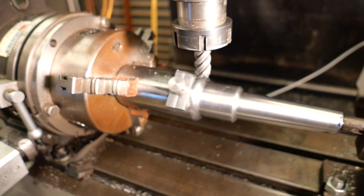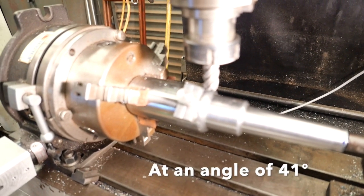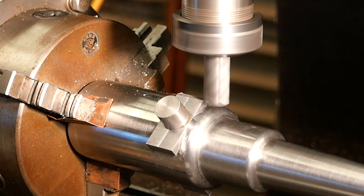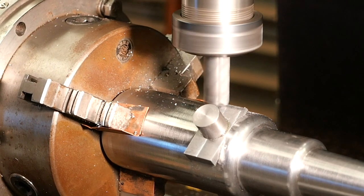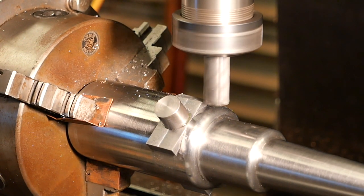As you'll see in a moment, this is quite a test for the Loctite — it's an interrupted cut. We take a one millimetre depth of cut going at a thousand RPM, feed rate of 200 millimetres a minute. That seems to be working okay; I'll show you the finished cut in a few minutes.